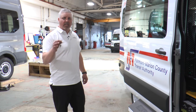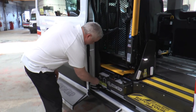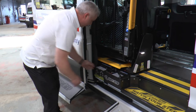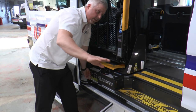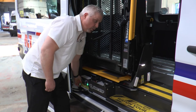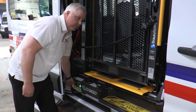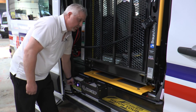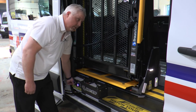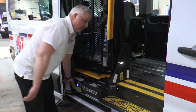Each shifting step also comes with a key override. The key can be inserted here and rotated to the right to shift right. It's important to note that the key override overrides all the safety features previously shown. This is a great diagnostic tool — good for an operator to override the safeties, but remember the safeties are not working when using it.